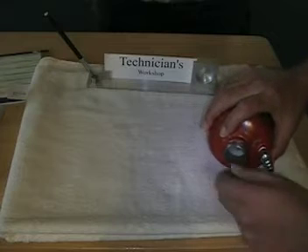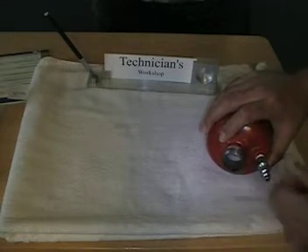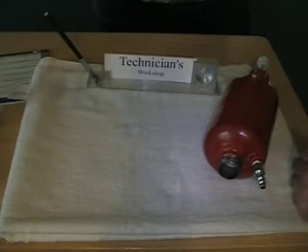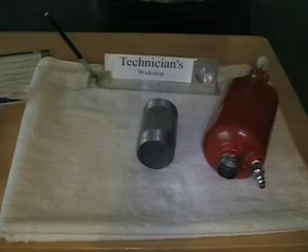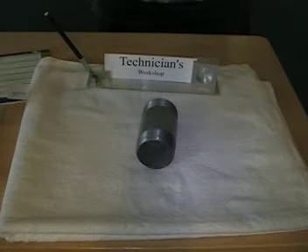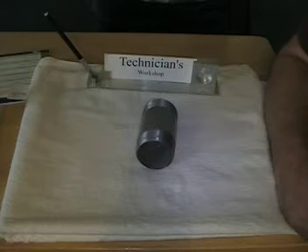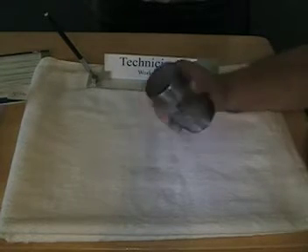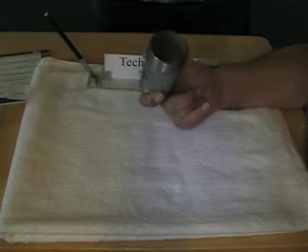The inside of this valve pipe — the valve body — is very, very nice and smooth. But when you buy a pipe, they don't come that way. They don't come nice and smooth and ready to be a valve cylinder. So without a machine shop, how do we go about fixing that? Like you do in a lot of woodworking and body finishing, you sand it.